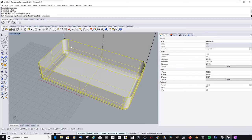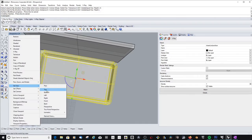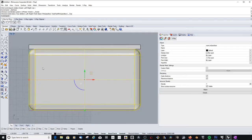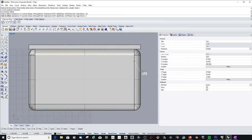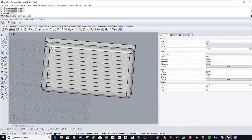Here I was already thinking about the thickness of my wall for the tray, because you have to think about the printing and how to produce it, especially the nozzle size. So I was using a 0.6 millimeter nozzle, so that means my wall needed to be a multiple of that. So I have a certain wall thickness, I have an infill, and that needed to be thought of.